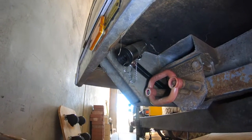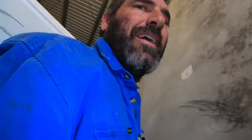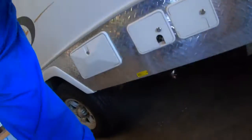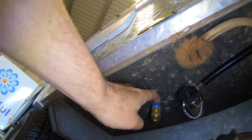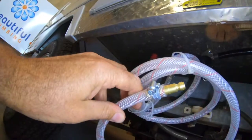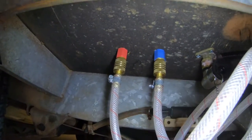At the bottom on the other side we've got the other bayonet tucked up there - that's for the barbecue they can hook on at a later stage. It all sneaks under there nicely, got the tee over there all wired up with diesel leak detector on them as well. What I've also been doing is putting heat shrink on the bottom of the hoses - red for hot, to distinguish from cold - so it's very easy to know which is hot and cold. You just plug that in and water comes out the other end down the hose, and you can hook that into the other side to confirm the hot is working as if it's been through the hot water unit.